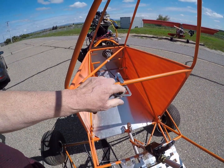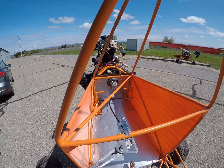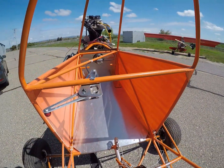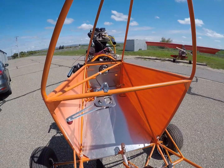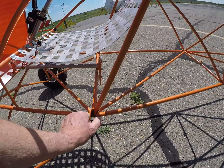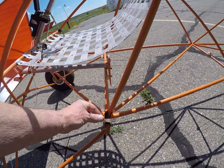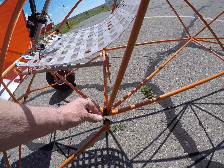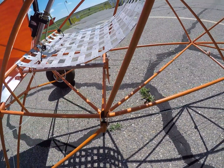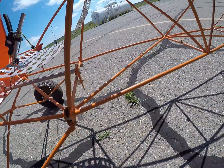There are lightning holes on the throttle cable area and a little piece of aluminum up here to lighten it up. The rudder pedals are 0.028 wall. The floor is 0.016 aluminum, just like on Orv and as the plans show. The original ultralight version called out 0.125 thick; on my Legal Eagle XL, Orv, those are 0.090 — on this one here they're 0.065. We'll try and see how that does. Got my pulleys mounted and ready to put cables through.